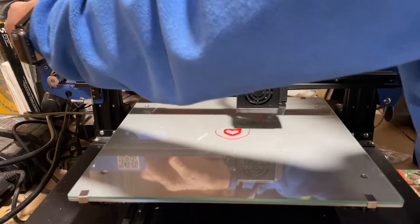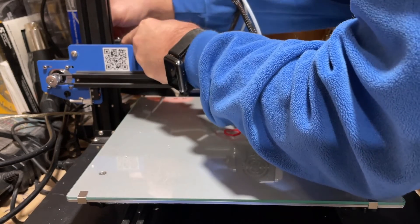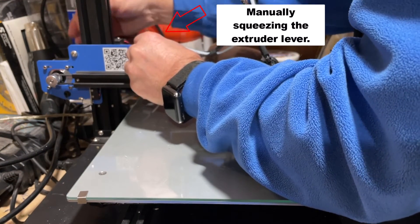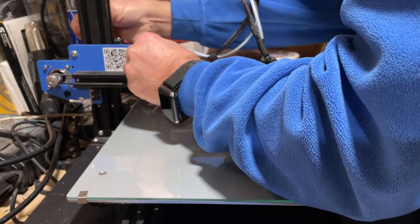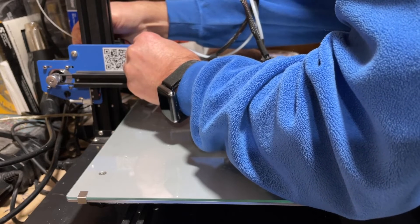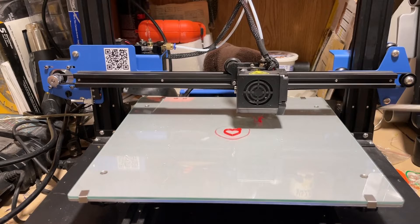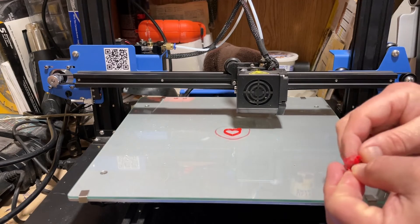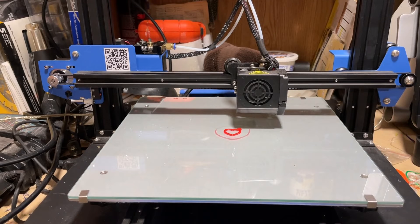Push the filament through and get it inside. Give it a squeeze. Once you get it in I can just push it all the way through. Then I want to manually purge this, so I'm just pressing a little bit more firmly. If you look down below — using a little screwdriver so I don't burn myself — it is switching. You can see that I have swapped filament and I'm starting to get clear out. Now I can just sit back and wait — she'll start up and finish with the glow in the dark filament.